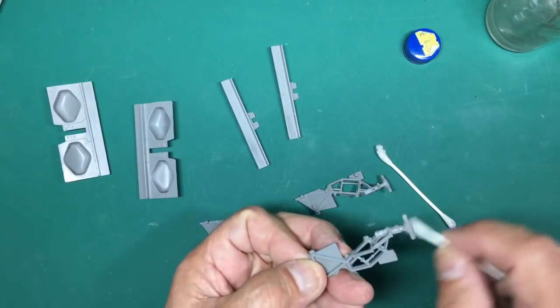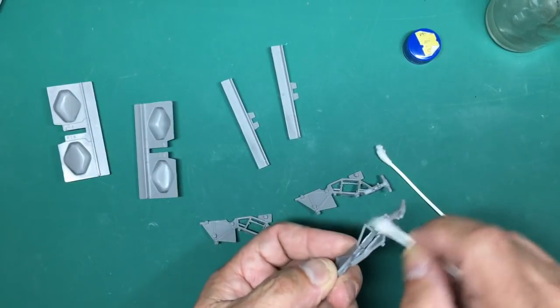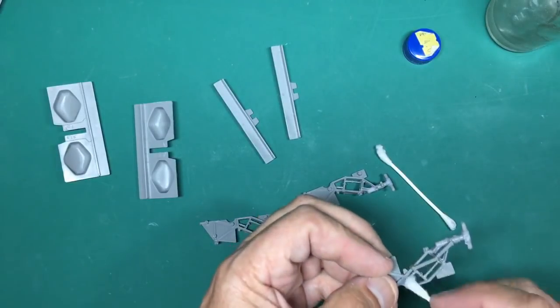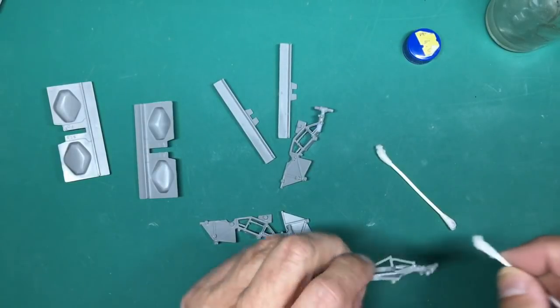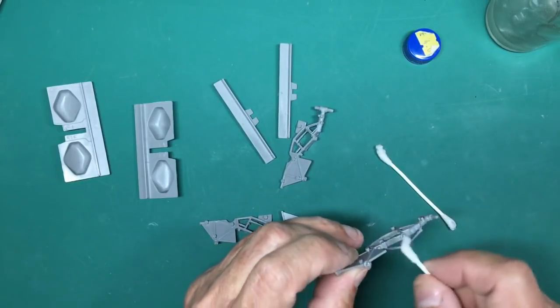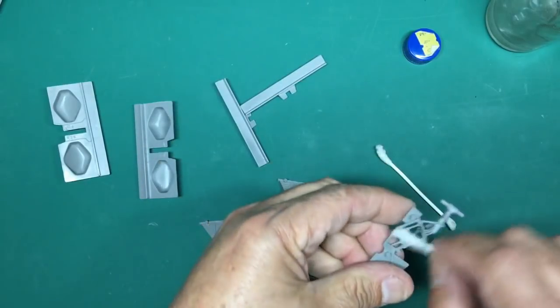And if it's a cold day, you thin your paint a bit more. If it's a hot day, you thin your paint a bit less. If it's too hot, you don't paint because the paint dries too fast. If it's too cold, you don't paint because the paint won't dry. And it's the same with resins and stuff and fiberglass. I've done many fiberglass mouldings for Rocket Bunny GT86s and all sorts. I've still got all the moulds for them actually.